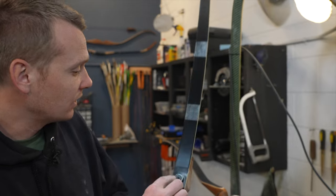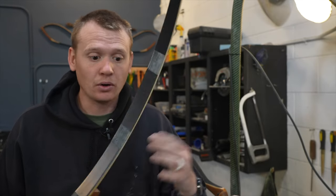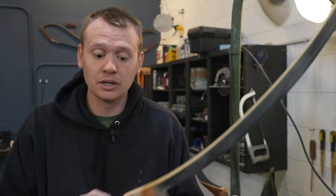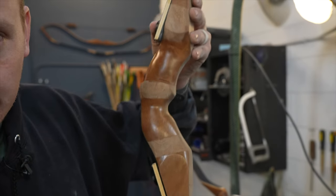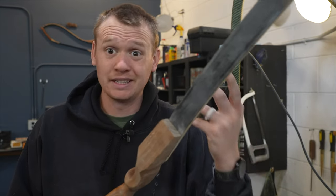The counter-argument is that your finish isn't going to stick as well because you're basically burnishing instead of sanding. But I've done tests — here's one of the limbs I tested, and you can see the spots where I had tape. I sanded it to 180, 220, and 320, then finished out all the areas. When you look up close you can see scratch marks on everything but the 320. And I've never had finish adhesion problems on fiberglass when you go to 320. So go to 320 on the fiberglass for best results, but on the wood stop at 180 or 220 — that'll finish better on wood. I did that exact same test on the wood and you can see the different layers with no visible difference from 320 all the way down to 180.